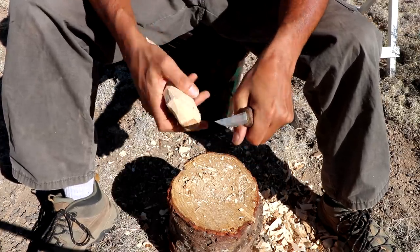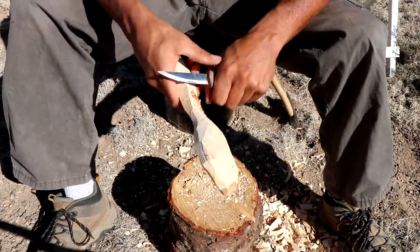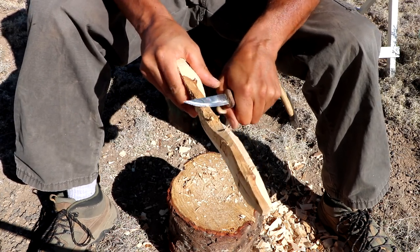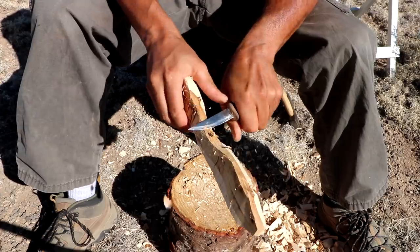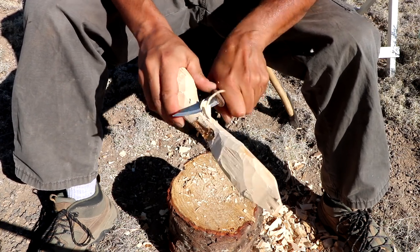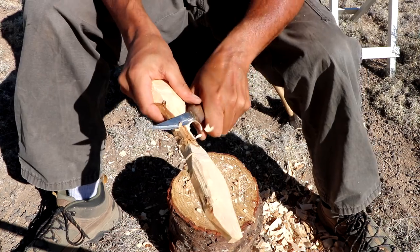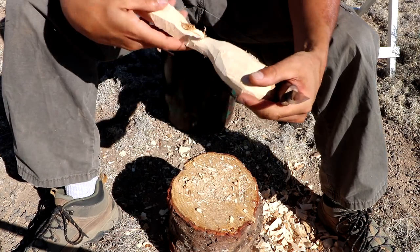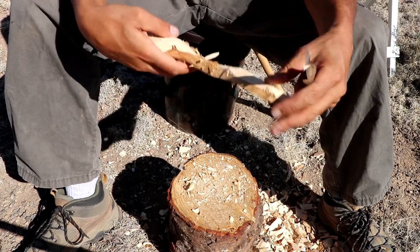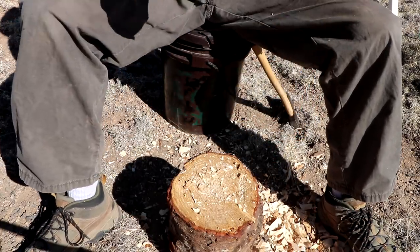This is one of the reasons I use green wood — it's a lot easier to do this bulk removal. The push cut allows you to do a shaving motion; you can really just work it, get those curls, and then come in from the opposite direction to get those curls out of the way — just keep doing that back and forth.